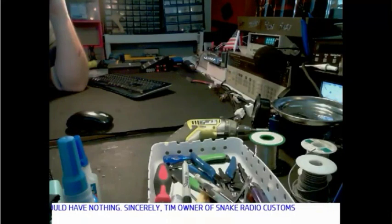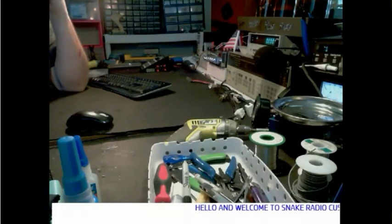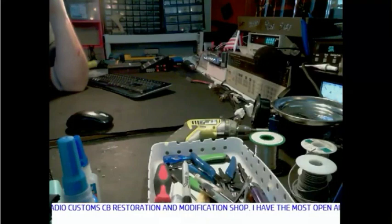Turn up the power until your audio starts getting a little quieter over the air, then ask somebody — hey, tell me when my audio starts getting quiet. Turn it up to 2 o'clock, and if they say it didn't get any quieter, that's fine. But if it got quieter, that means you're saturating the input of the amp too much, so you back it down to 11 o'clock. That's the analogy.